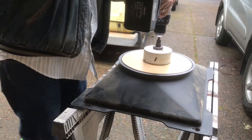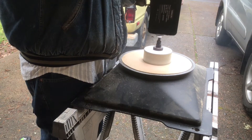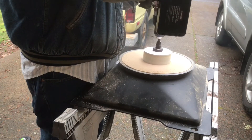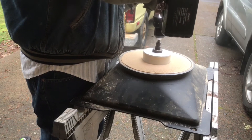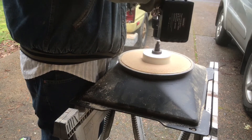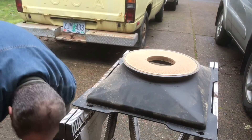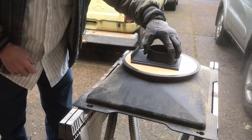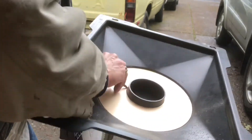Now when you're cutting with a hole saw, no matter what kind of material you're doing, see how I kind of wobble the hole saw? That's because unless you're using a drill press, you can't actually keep it perfectly level. But this allows you to make sure that you're cutting all the way around the wood, not just on one edge. Once we get that cut — see, it sets right on there. It falls in, and that's my valve that opens and closes for the suction.